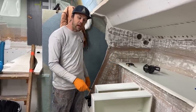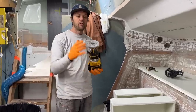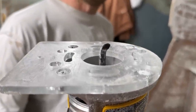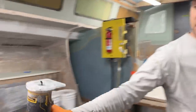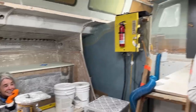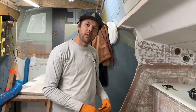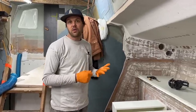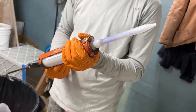This is the way we're going to protect the foam edges without making the drawer any wider — we just dig out the foam. I have a special router bit on my router that I made myself: I just cut off the end of an Allen wrench. It's great for digging out the foam, and then we'll fill it with a two-part pre-thickened epoxy that comes in a tube.